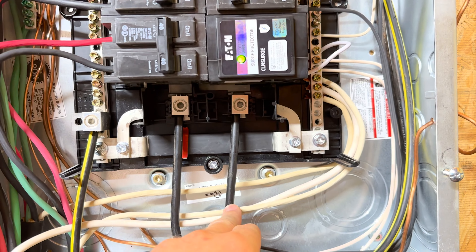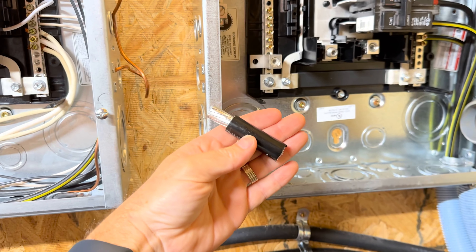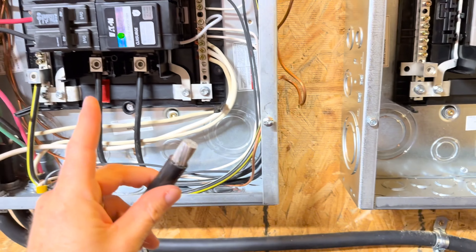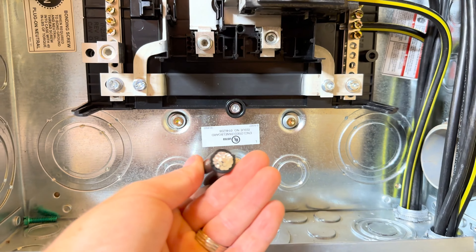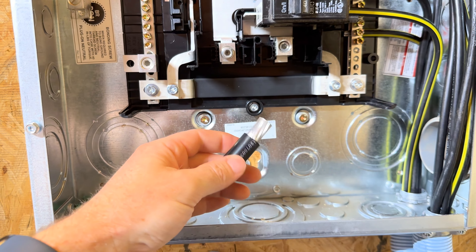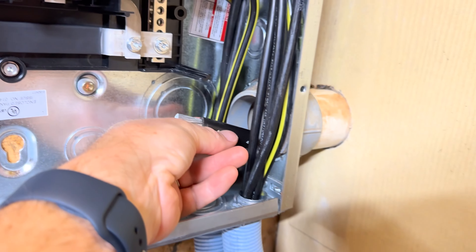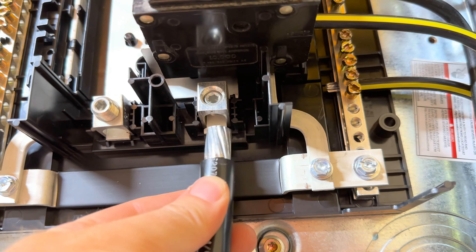One of the problems I have here is that I've been running this six-gauge wire, and what I'm going to be running is a four-aught, which is absolutely massive. So the difference in the two is pretty substantial. I'll show you the problem I'm running into — I'm going to be coming out of my main distribution panel, coming from the power pole into this box. And as it gets in here, the problem is the wire is too big and the hole is too small.